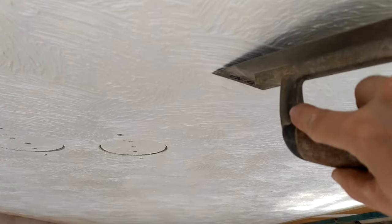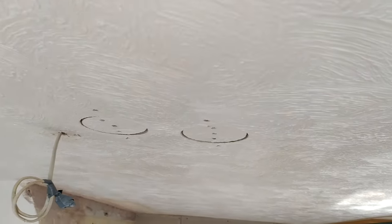The second thing is the timings are slightly different when you're dealing with Artex. Because there's a thickness, you're going to apply the plaster thicker than what you would do if it was a standard ceiling. The timings totally change — not drastically, but the first four stages of plastering, the timings change. I'll go into great detail, so make sure you watch the video. People really struggle with this concept, so make sure you watch and get the sense of it as we go.